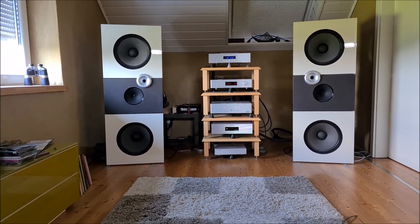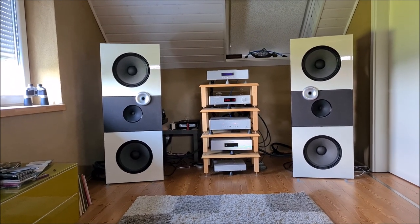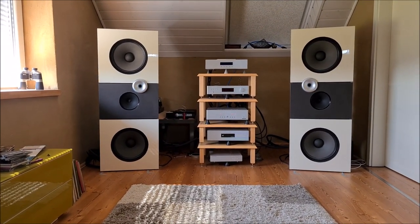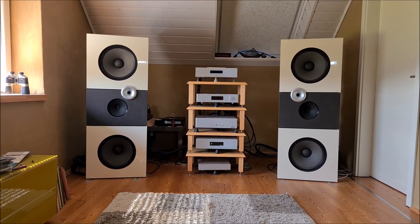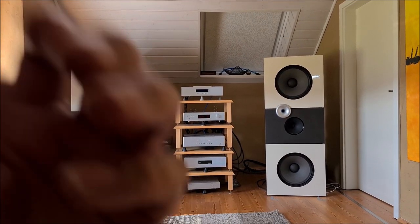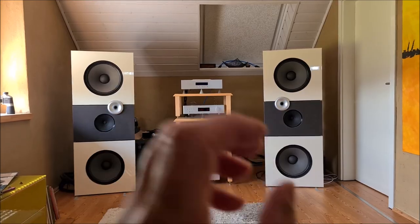To Miflex. This was Rika Audio Capacitors. And now I will change the tweeter capacitor, 1 microfarad, to Miflex, copper, paper and oil. So Miflex are installed now and fresh, I think half an hour, and it's no burn-in time, so I think it's a little bit closed, but you can hear the differences very well, and be aware it will be loud now, because I'm talking from behind the microphone, okay? And after this music example, I will tell you something about what I think about these two capacitors, Rika Audio and Miflex.